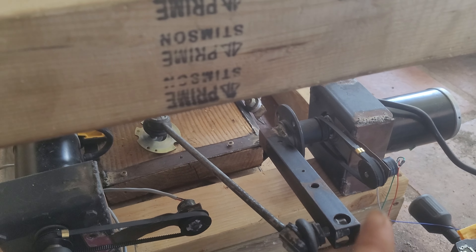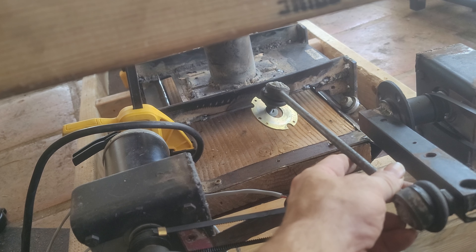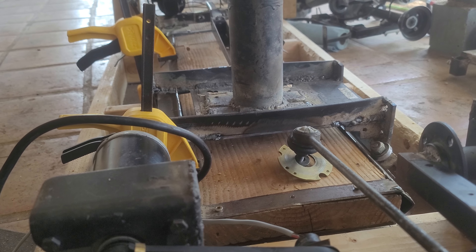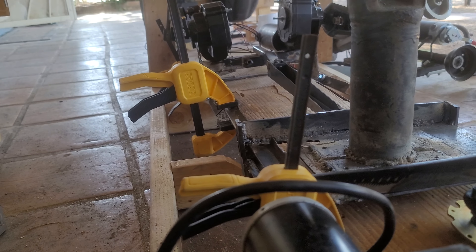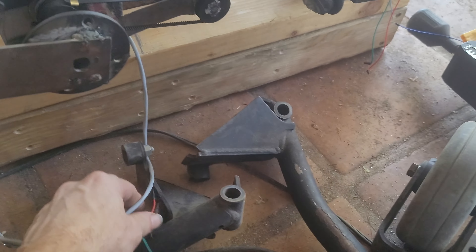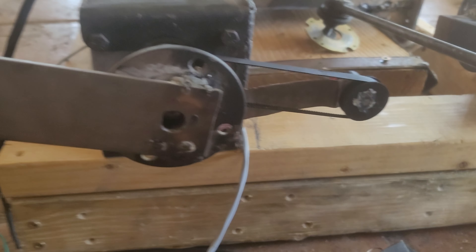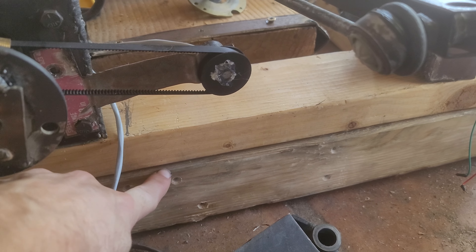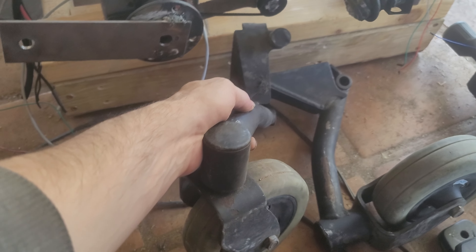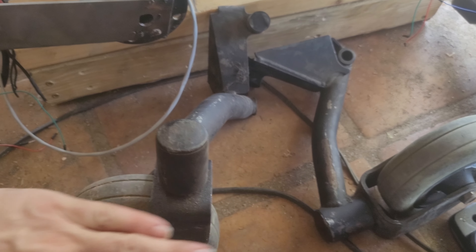Now I'm going to keep this idea, move the traction loss motor all the way out to the edge, and then mount the surge motor right there. The surge motor will then be connected to this trolley. I'll make a brace to connect that connecting arm to the trolley. Getting it welded up and making those two things one solid piece is the most important part. Then I need to make back plates for these two trolley wheels — clean them up, make back plates, drill the back plates, and mount them to these two two-by-fours. Then the caster wheels will be on the outside.